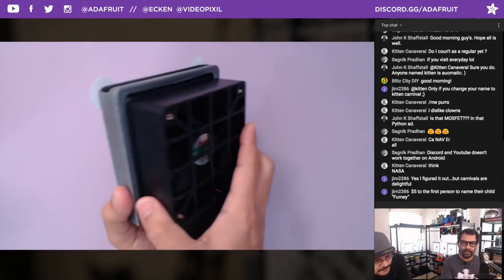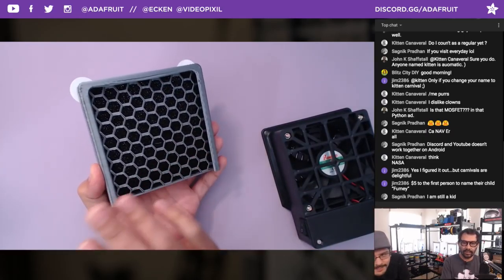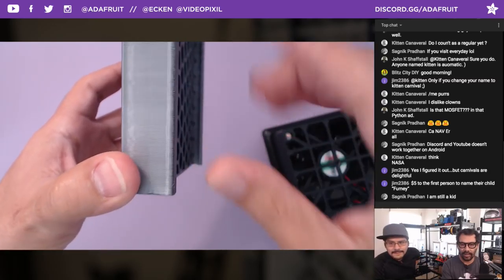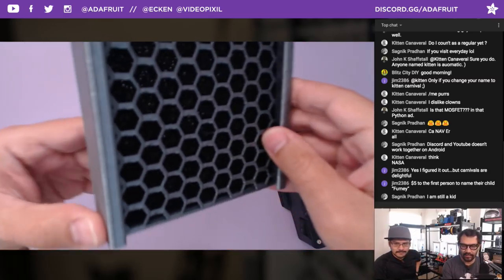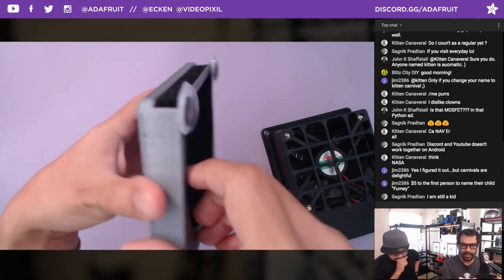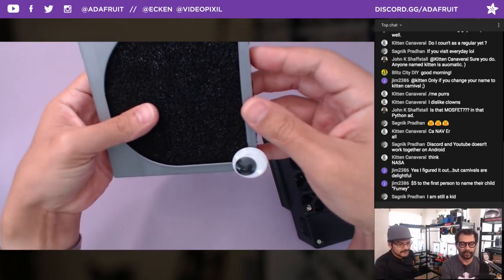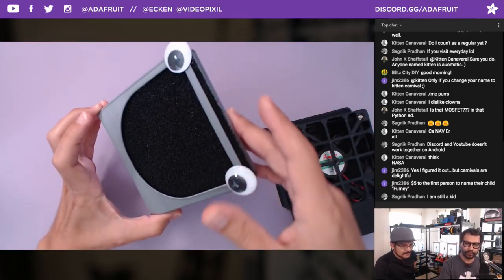The most impressive thing about this is, of course, all of the overhang that I was able to print with all this crazy retraction at a 0.4 millimeter layer height. That's using a crazy 0.8 millimeter nozzle print core, with no support material on this. This is quite impressive. It's like a torture test for your 3D printer to see its capabilities. It has a ton of retraction movements.